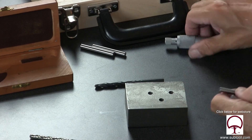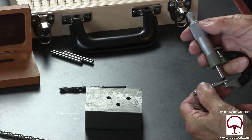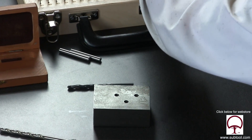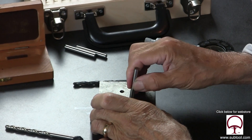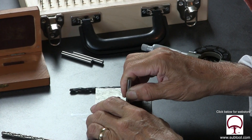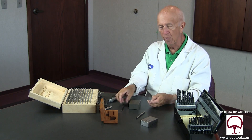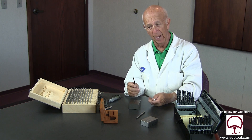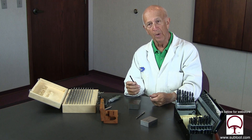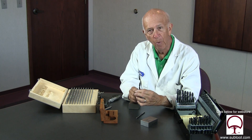That's 249. And just to prove it — there's 249, folks. So that's a 249 pin. Here is a 250 pin — it won't go in the hole. What the heck is going on? How could this same drill drill 8,000ths oversize the other day but now drill 1,000ths undersized? Well, to our surprise, it's all in the point.